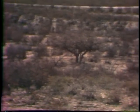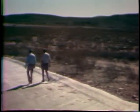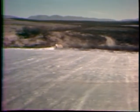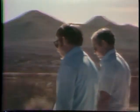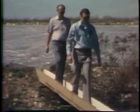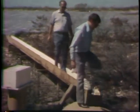In 1970, as one of their demonstration projects, 1,000 square meters of sloping desert ground were cleared of cactus and brush. A fiberglass matting was rolled directly onto the rough soil, then covered with asphalt and a protective aluminum paint. The fiberglass serves as a reinforcing fabric, and the asphalt provides waterproofing. In the ten years this catchment has been in place, very little maintenance has been necessary. Virtually all of the rain falling on this surface is harvested. From only one centimeter of rain, this catchment can produce over 8,000 liters of good drinking water.